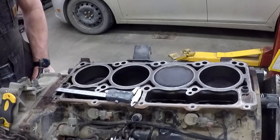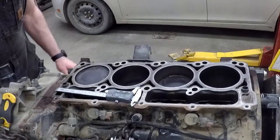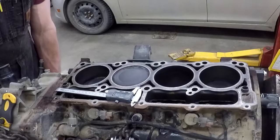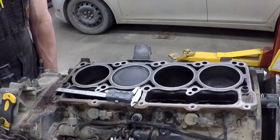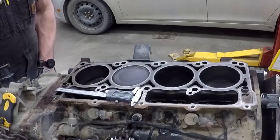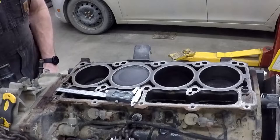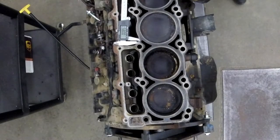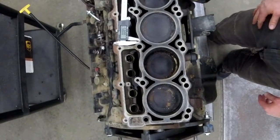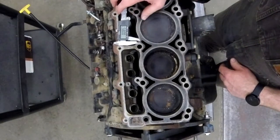What we're going to do is make it so that this piston right here is all the way at the bottom. So we go all the way down — I see it sort of stop and start to come back up — and I'll get it in that happy spot. I can see also that I have this piston at the very top, and because this piston is at the very top and this one is at the very bottom, I know that I'm right there.